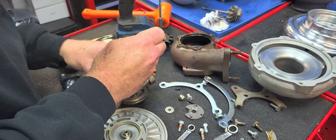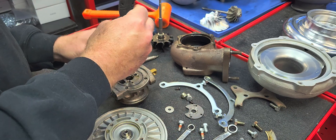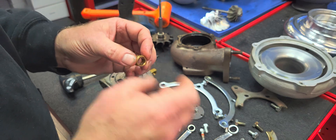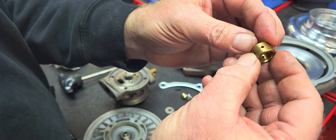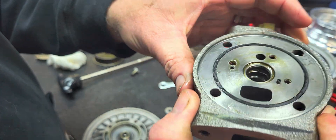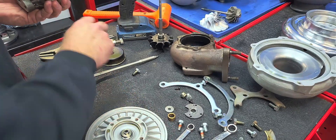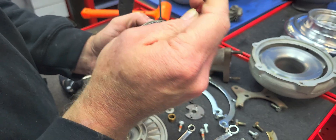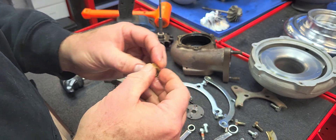Let's pull a journal bearing out of this guy. The bearing is very, very nice. The bearing housing still shows cross-hatching marks in it — it may not be translating onto camera very well, but the bearing housing shows no signs of contaminant. Pulling the exhaust side journal bearing out — I have a couple of scratches on it, but nothing bad.